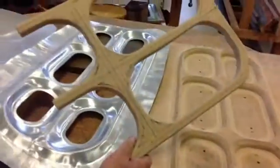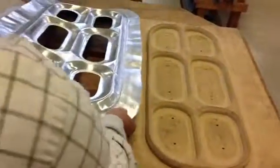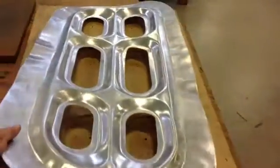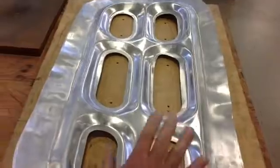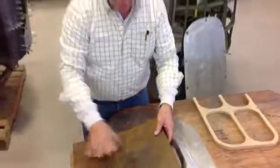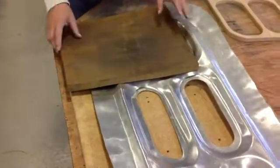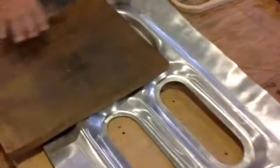This is a cutaway — a small piece where we cut it, route it, and we would take a sheet of material, soft material, and it would lay down over this pattern. What we would do is go to a press and do multiple layers, pressing this down to seat it and form that area. Then we would actually form the windows.